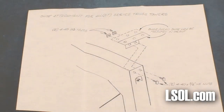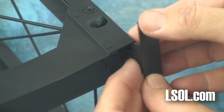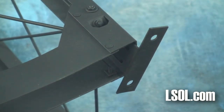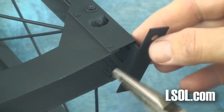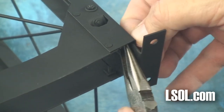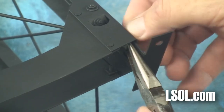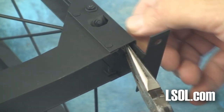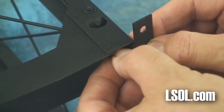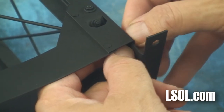There are some simple instructions on how to use the brackets. We tried many different ways and found that the easiest way was to lay it on its side so that you can get to both sides of the truss easily. We found our fingers were a little fat to get the nut started on the bolt, so we used a pair of needle-nose pliers to get the nut started, then we could get our fingers inside. There are some bolts and nuts inside that block it a little bit — it's not hard, but it's not easy for the first one.